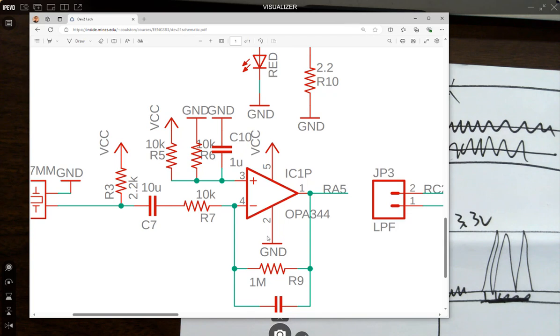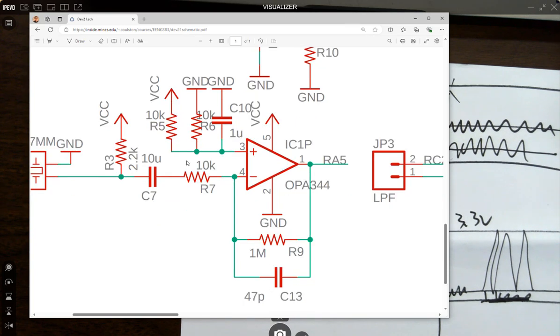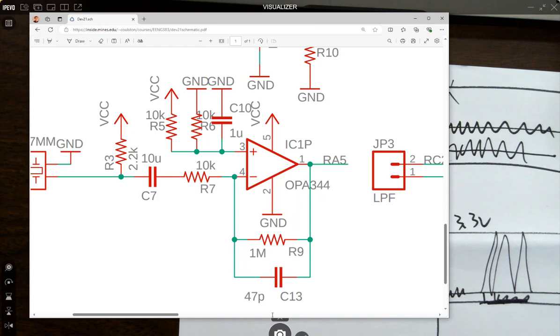Okay, and then it's followed by what? This is a low-pass filter. Why a low-pass filter? Because there probably are some high-pitched, high-frequency noises in the input. Because you didn't block high frequency, it's a high-pass. So when high frequency comes in, you want to remove some of the high-frequency noises. It's not your signal, not your voice, it's noise. Okay? So these are removed by this low-pass filter.